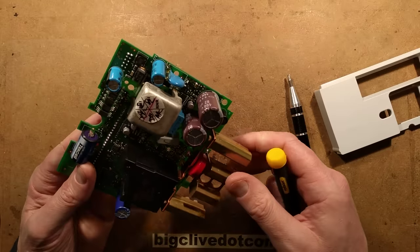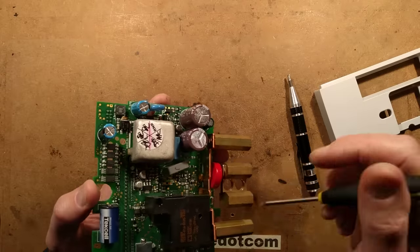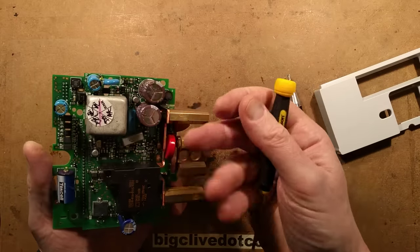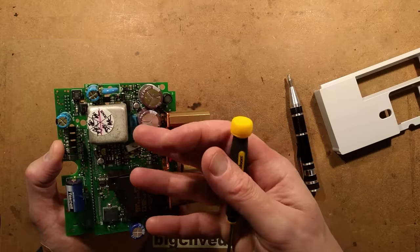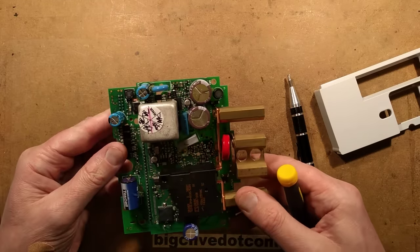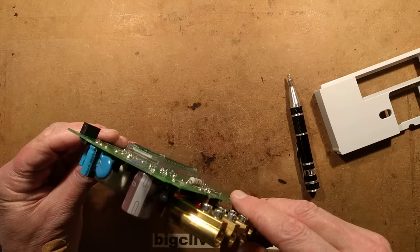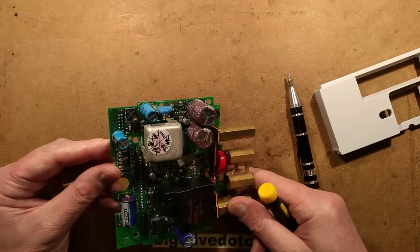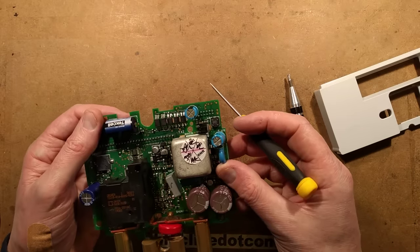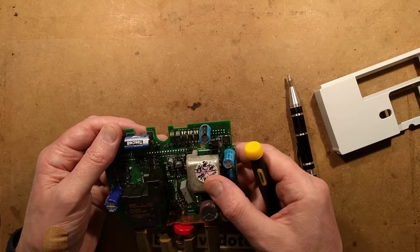The main board has big chunky terminals and a large relay so they can disconnect your power if you haven't paid your bill. There's also what looks like a hall effect sensor standing up - that may be to detect if someone places a large magnet near the unit to try to override the relay. There also appears to be a power supply module and isolators going out to the external modem unit.